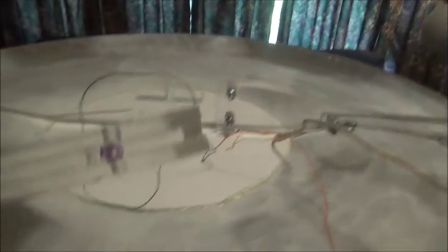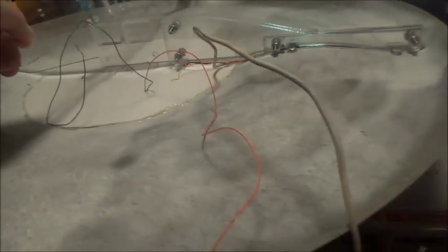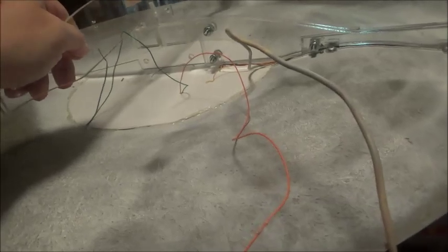Both the green and red running lights are affected by the armature, so I will need to drill into the top of the armature just so I have a space to put the LED. Now you can see the bottom is already opened up, and that's opened up for the running light that goes on the bottom. There's a pair of white LEDs that go on the bottom, but I need to drill into this to have room for the red and greens to come up through the top.